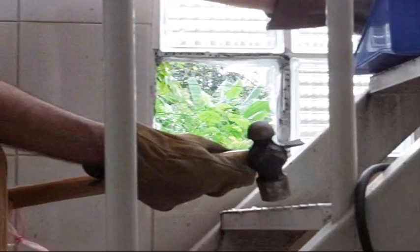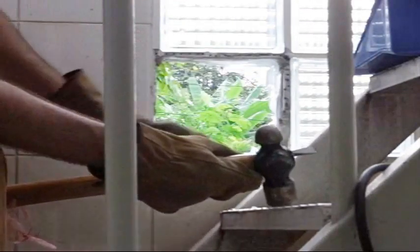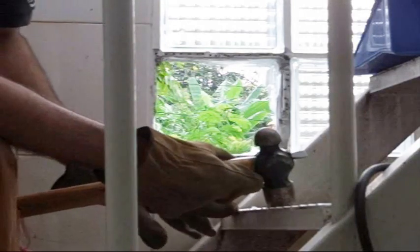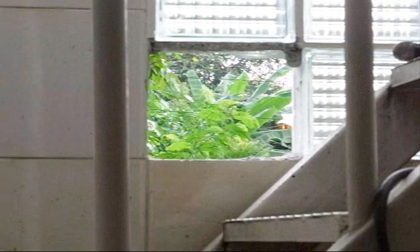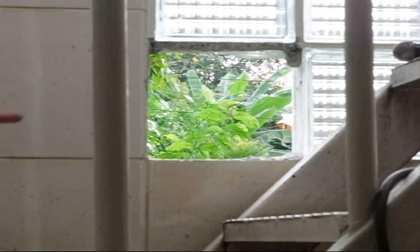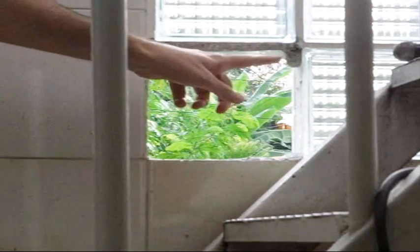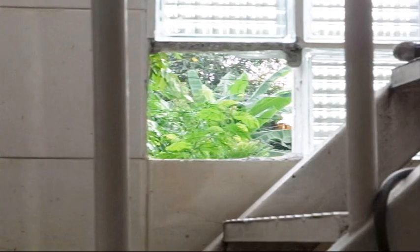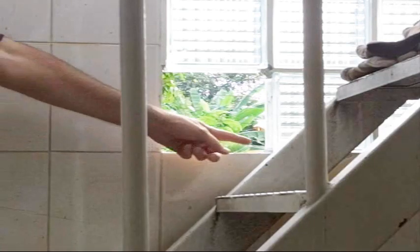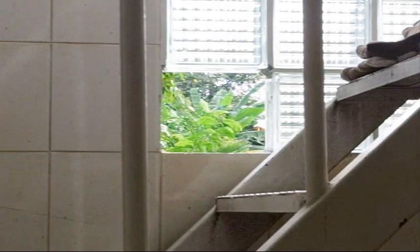Looks like I'm going to have to do some more drilling and chiseling here, so I'll take that off camera and speed things up. Basically it's coming out pretty nicely. I still have to remove this cement so I can get new cement in there, being careful of all the surrounding material. Notice that in this process it creates thousands of little sharp glass shards and they will go right through your gloves and into your fingers. So this technique of drilling and then tapping out the weakened mortar does work, and you can do it without breaking the stuff around it.